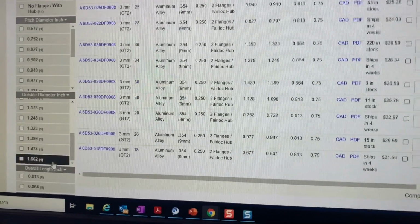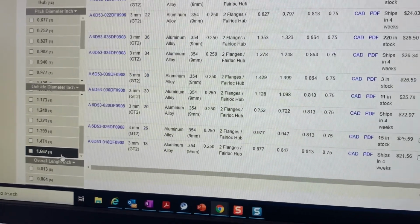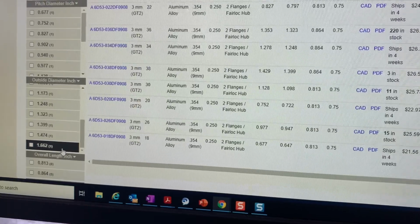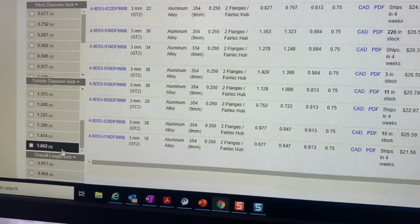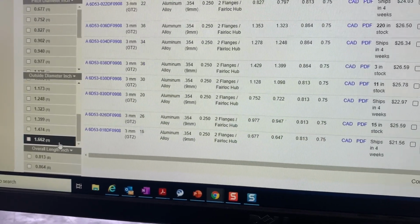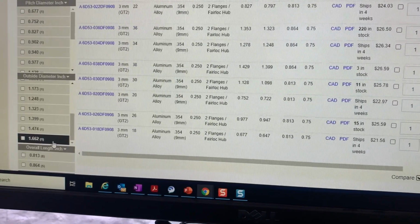And you see the largest one down there. I want to make sure that if I buy that one in the future, it will fit. So I'm actually going to plan for a 2-inch diameter pulley, and to get the screws laid out on my machine and have clearance for everything. That's my goal. So this is a little overview.